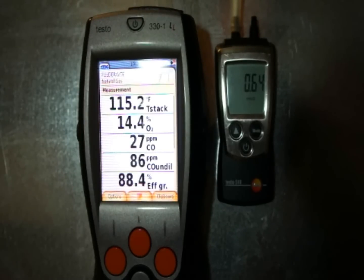The blower just slowed down — you can see stack temperature is dropping a little bit. CO is still around 26 or so and not changing very much. What's changing is our O2, and that's changing because with low fire, our secondary openings are fixed in size and we just can't get much more air in there than we have.